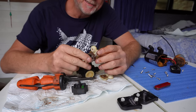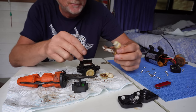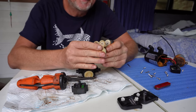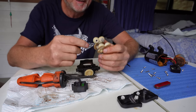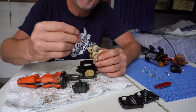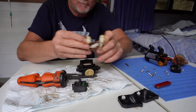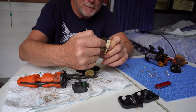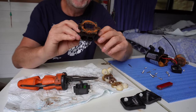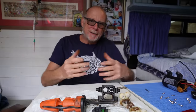Right, so it's hydraulic. It's basically simple hydraulics. This moves from side to side inside the pump like that, and if I put this back like that, it basically forces water from one chamber to the other side by side, using a side-to-side motion and these one-way valves. So one of these valves will be facing one way and the other valve will be facing the other way. So as this oscillates to and fro, water can only travel in one direction, and that's what makes the pump work, I think. There you go. Either way, it definitely needed changing.